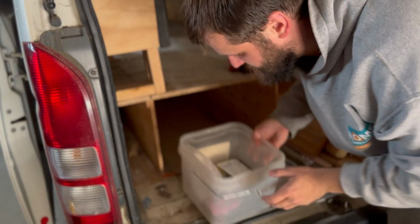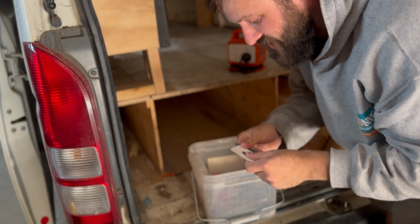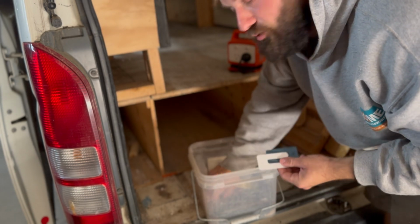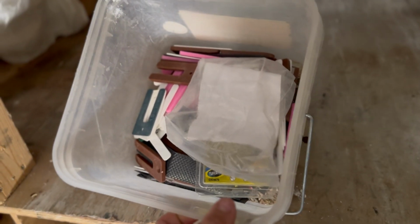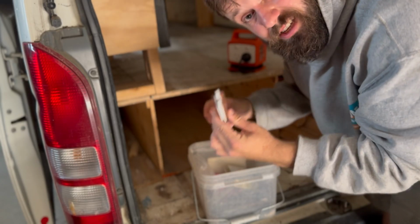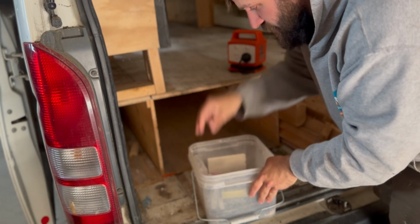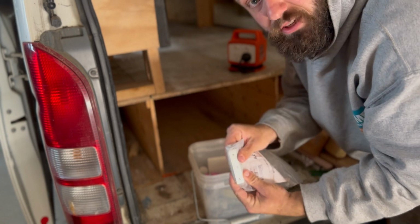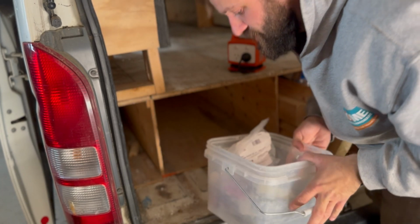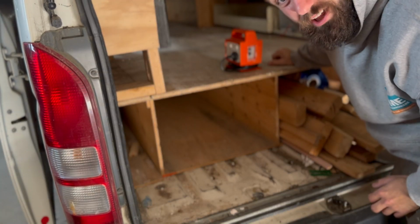I'm going to start with these just because they're right next to me. Now these are a box of window packers. Now window packers are very, very useful when you're packing windows or door jambs. You stack them together like this, especially on old houses, just to make sure you straighten the jamb, and just some screws that go with them. And I've also got some aluminium hinge packing screws. So very, very useful, and I think this was full at the start of the week. So I really go through quite a lot of those.